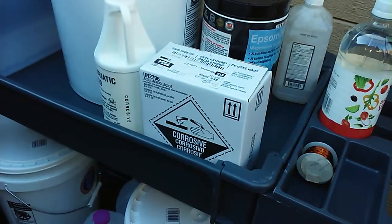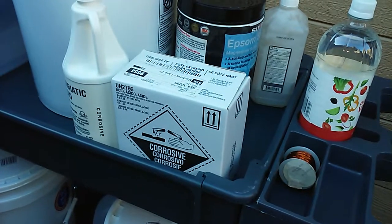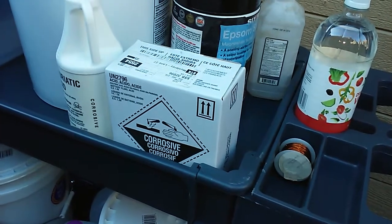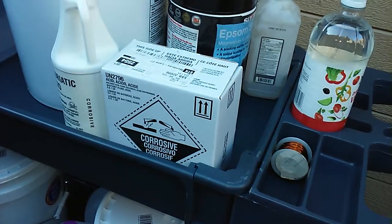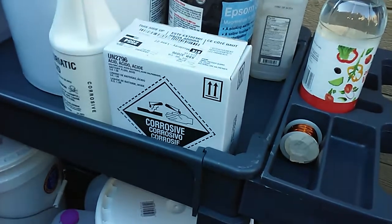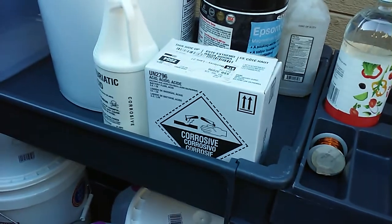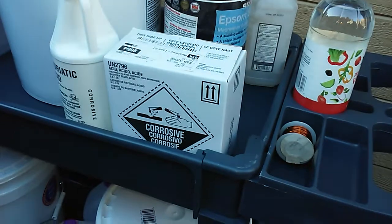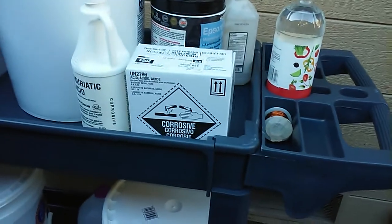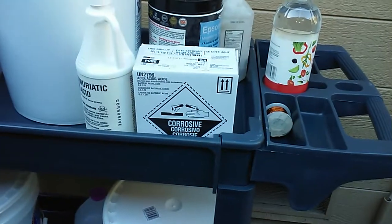This is battery acid — sulfuric acid — and this would be for pickling. It's also used as a pre-dip for the chromate bath, which is the second step of the plating process, whether gold or blue chromate. You pre-dip in acid before the chromate step. I'll go over the actual percentage later — something like five to ten percent acid to one hundred percent water mixture.